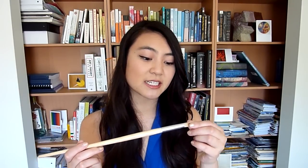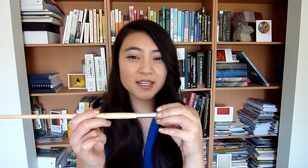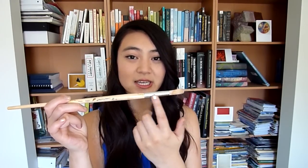For brushes, you always want to clean them right after you're done painting. Even if you're switching to another brush, clean it before moving on. If paint dries on the brush it'll be almost impossible to get out. One thing to be careful about is the metal part called the ferrule — it's typically held together only by glue. So if you have a dirty paintbrush, don't just sit it in a liquid and forget about it, or the brush can come apart or become misshapen.